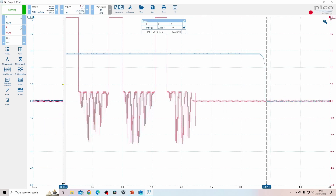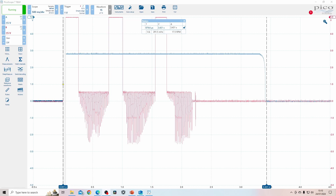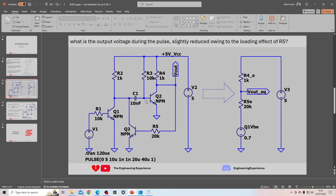Another interesting thing to note: if you trigger the input pulse twice, the output pulse is its fixed duration and does not change. Triggering it again will not affect the length of the pulse. That's because when you press this button you're connecting this point to ground, however the capacitor is already connected to ground with Q3, so the button is no longer having an effect on the capacitor.